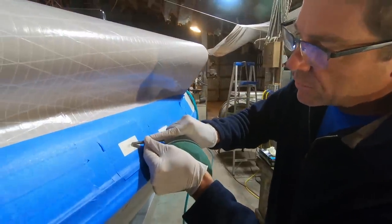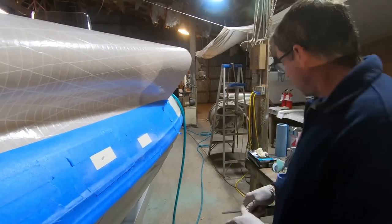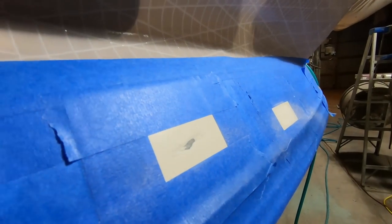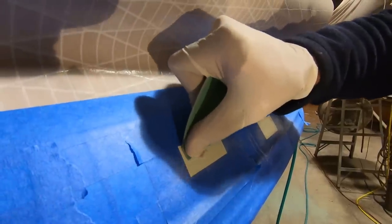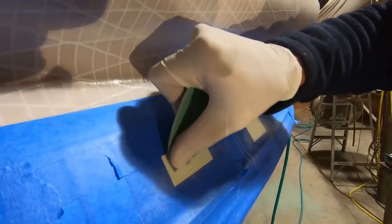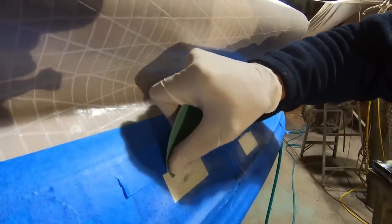The loose material was prone to flake or chip off and it may seem like you're just making the area worse, but trust me, that's what you want to do. We've rasped it and you can see it's got a nice deep groove in there. This one's more damaged than the first one. No power tools needed — I'm just going to feather out away from the edges. Something like this, a lot of times finesse and taking your time is the way to go.